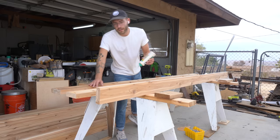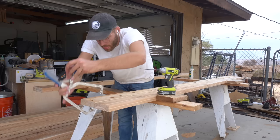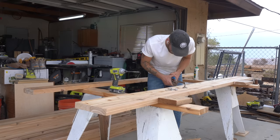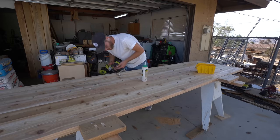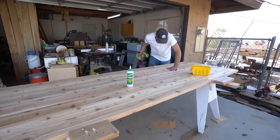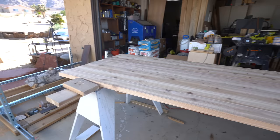This is a really cool setup if you have limited tools — just the jig, a clamp, and the same drills you normally use. And if you don't have a lot of clamps for big tables, this could be a great setup. Clamping and screwing each board really makes sure that even if you're not building on a perfectly flat surface, you're getting a really flat panel with all your reference edges butting up 90 degrees. The screws are here for alignment and to hold everything in place while the glue dries. And here we have our first 10-foot long table for the order — we just need two more.